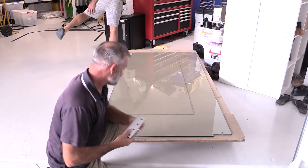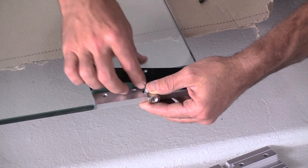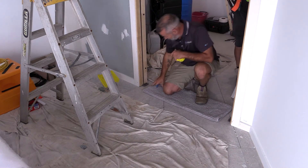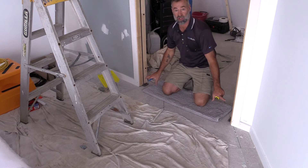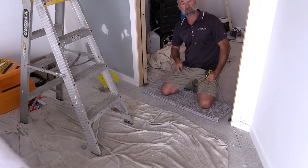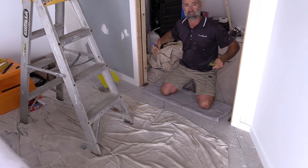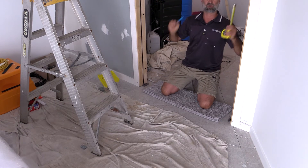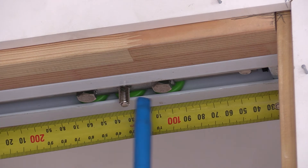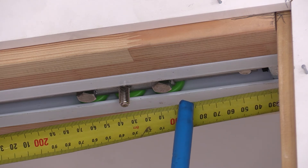Now that our cavity's in, the last part is the installation of the glass door. We've got these heavy duty brackets that attach to the top of the glass - I'll screw those on now and carry it upstairs. A couple of quick tips before bringing the glass up: pack the bottom to where you think the door is going to be sitting. Being glass and quite heavy, you want to get this pretty close. Also adjust these track rollers close to where the brackets are on the glass, so when you lift it into place you can make adjustments without maneuvering around too much. Lastly, adjust this bracket so it lines up with the glass - just loosen these two bolts and slide it across.